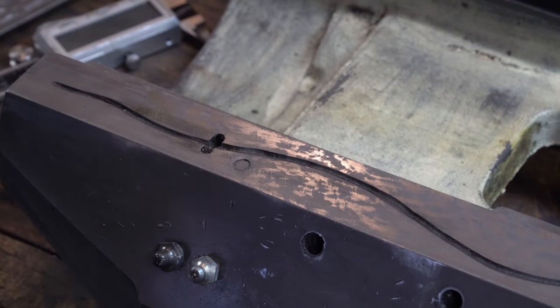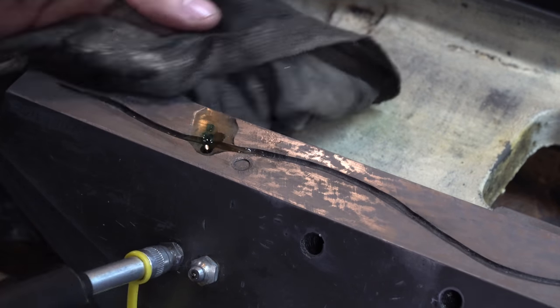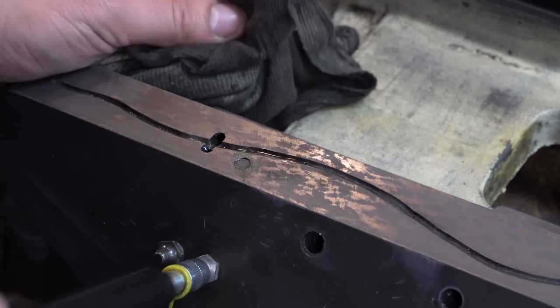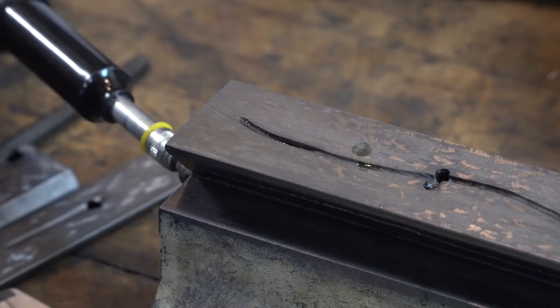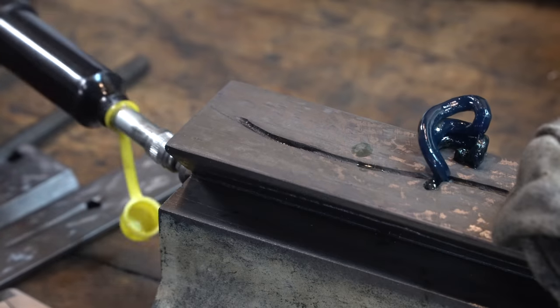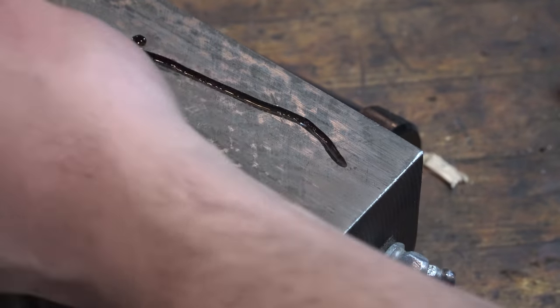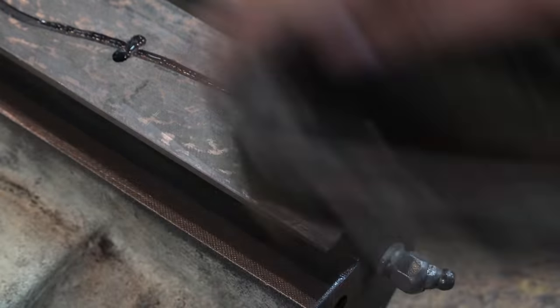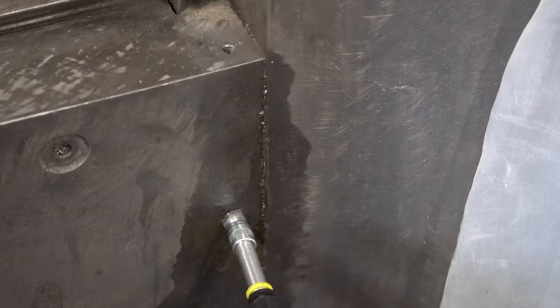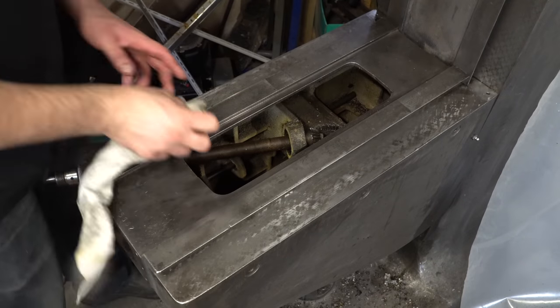Now we wire wheel the whole table — that took a while. And now we're going to remove the grease from inside all the previous oil lines. I have this little plunger oiler filled with 30 weight oil — when you press down, it squishes the oil into the greasers. These are awesome. I believe this one was from McMaster-Carr. This is what I'll use to periodically add oil to all areas that need it as I use the mill now — I'm trying to convert it entirely to oil, even parts I couldn't disassemble.